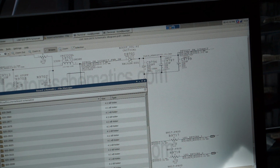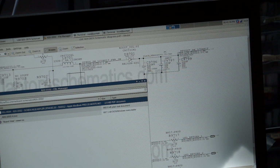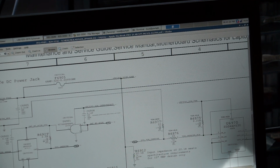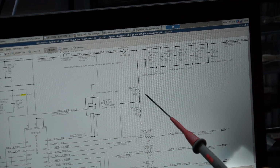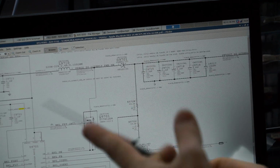Yeah, so I'll show it to you on a retina board, because there's a retina board that uses the exact same backlight IC, almost the same backlight IC. U9701. So the circuit is a little different. So feedback is going here, and then here goes to, after the diode, backlight output. So again, most of the circuits are like that.